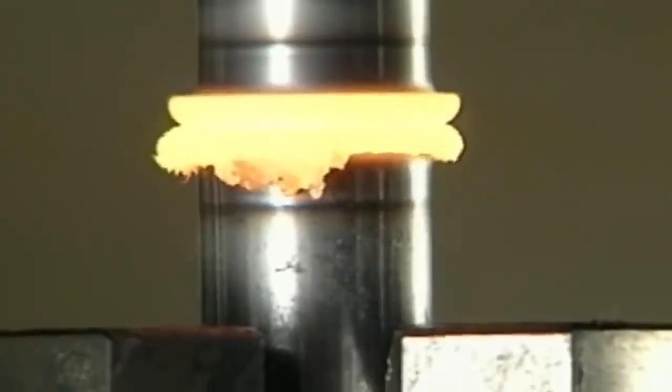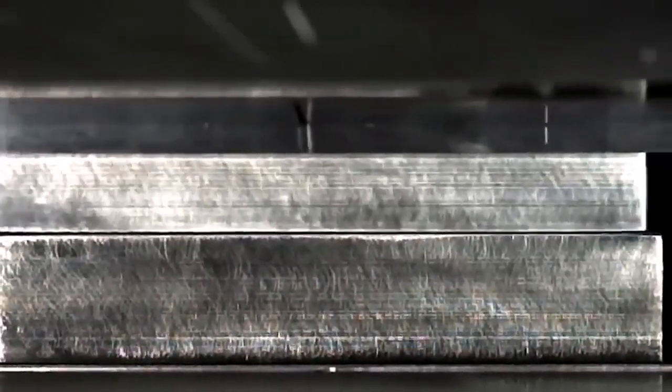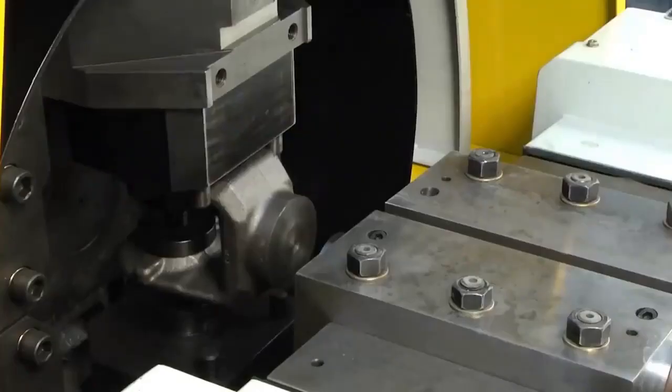The process can be divided into three stages. During the first stage, the frictional force destroys and removes the oxide films present on the surface in the initial state. During the second stage, heat is released and the material becomes moldable under its influence.